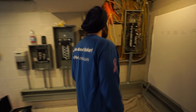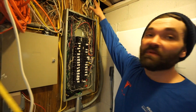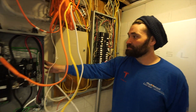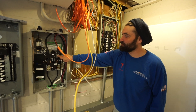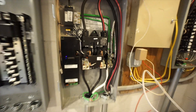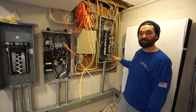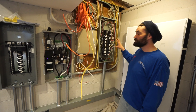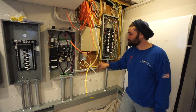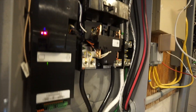Can you take us through it a little bit? So what we did was we had to replace the service entrance cable from the meter all the way to the gateway. Now we installed the main breaker here and the main breaker is feeding the house, and then everything that were your loads in your house are now the sub-panel. We had to run new 3-0 wire into the trough and that's going to this 200-amp breaker up here.